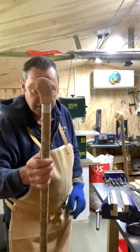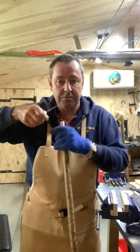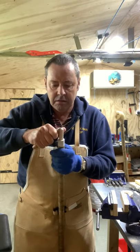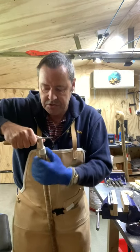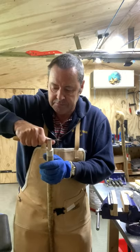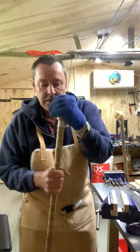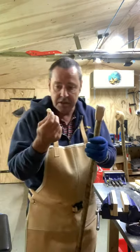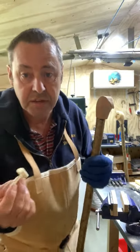Now that's not going any further and I know there's nothing wrong with that peg. So the only thing that can be wrong is that the peg's slightly too long, which often happens - I only measured it with my thumb. So all I do is take the edge off the very end, carve it into a rough point, and then nip off that point with the blade - you can do it with a saw if you want to, but it's easier and quicker to do it like this. You do need a good sharp knife though. Let's see - right down. I'm going to take this tape off so we can see the edge better. All that comes off is that loose flaky dandruff on the outside of the stick - you're going to sand it off anyway so don't worry about that bit.